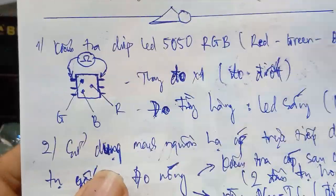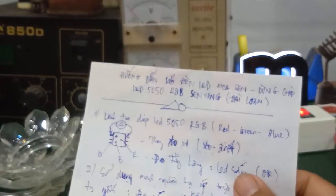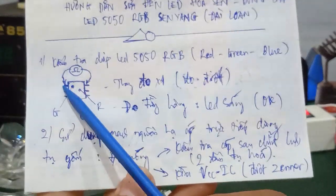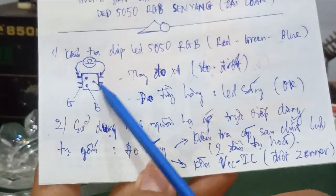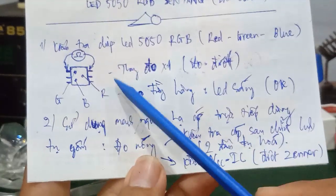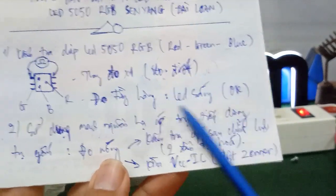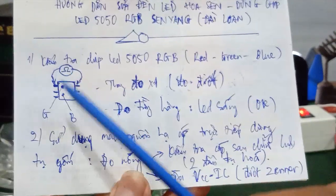You test it by using an ohmmeter. If you have an analog (needle) multimeter, set it to the ×1 ohm range. If you don't have an analog meter, use a digital multimeter and switch to the diode test mode. Measure each row one by one — for example the top row with 2 pins. There are 3 rows here. When you see the LED light up, it is OK. The operating point for this RGB LED is around 5V DC.